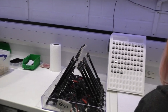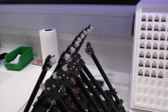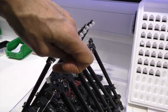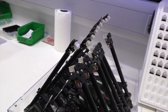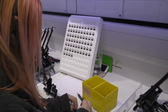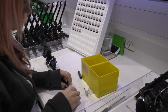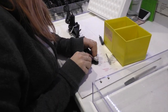And now the cartridge goes in here. Now, who sets the overhang on this cartridge? It's fixed. Everything is tolerance, so the stylus is level, and the correct position is the front of that hole. Ah, I see. And on most of the other turntables, there are three-point cartridges in a fixed position. But the turntables are made with the arm hole within 0.5 millimetre tolerance. Make it easy for people that don't want to get the gauge and do their own. They can, yeah.